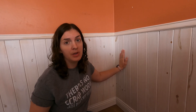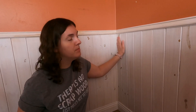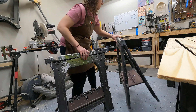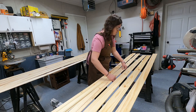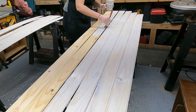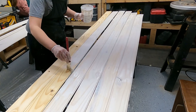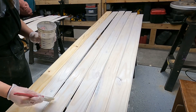Because this wainscoting has been on the wall already for four years, it is going to look slightly different than the rest of the room, and that's just because the knots have all had a chance to bleed through even more. When I installed this the first time, I installed it without whitewashing first. I knew that it was going to be possibly a problem because of expansion and contraction, but at the time we had a one-year-old and we had just moved into this house. So I just did it quickly, and you can see in some areas in the cracks where it has expanded over time. So this time I did things right and I whitewashed and clear coated them before I installed them on the wall.